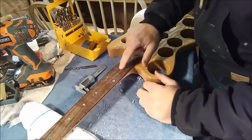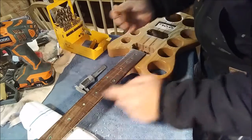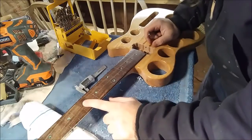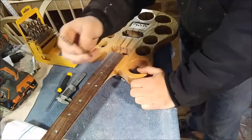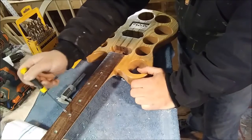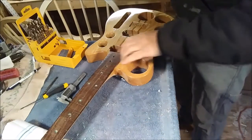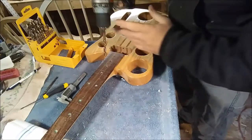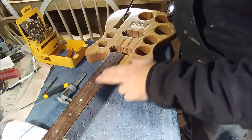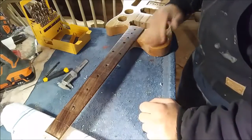Some of these broke out - most came out, some didn't. No big deal, now we're going to take this over to the drill press. After I drilled them with the small bit, I was actually able to take a screwdriver and pop most of this stuff out, leaving a big enough hole where I don't need the drill press. I can just put the 5/16 bit in my battery gun. I've already drilled out the bottom two - I'll just go up through and drill the rest out with the battery gun pretty easily.